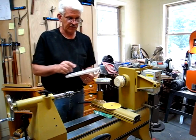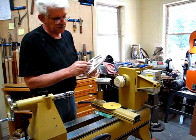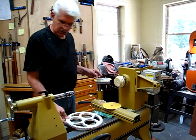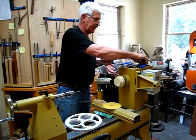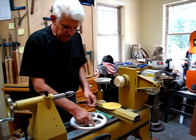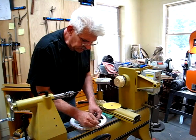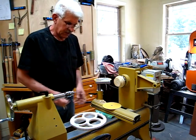If it's not perfect, you're going to have a little bit of white paper past where at other places you went all the way to the black line and took it off. What you need to do in a case like that — this is a real simple trick — you just take a thin piece of wood like this, cut it to the correct length, take a colored pen that is a different color from your printing, which is probably black. So you probably want a blue pen or maybe a pencil. Then you use this to draw your line around there. That will give you a perfect circle for sawing your teeth out to.